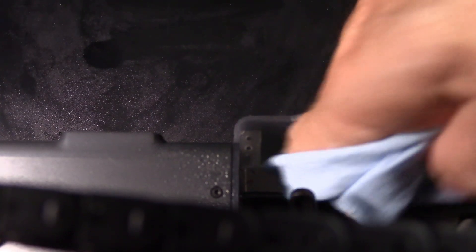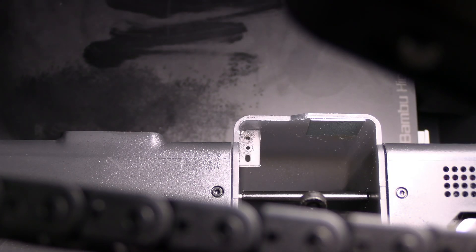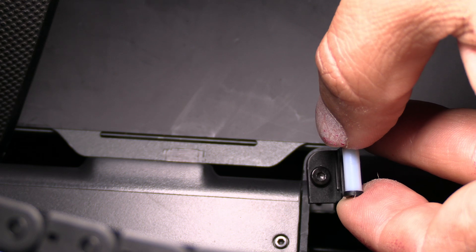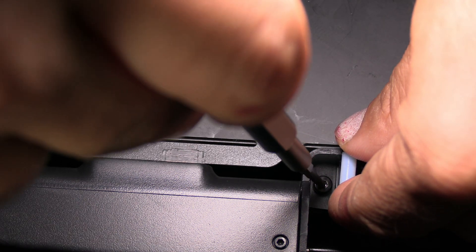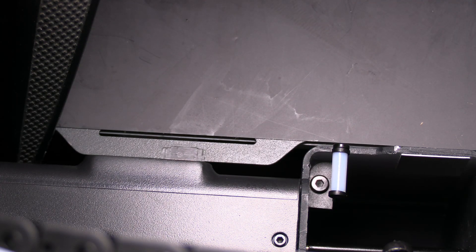While I'm in there, I'm going to rub this little door and the walls all around it. Because if the walls of your poop chute have anything sticky on them, it can prevent your poop from properly sliding down the chute and out the back of your machine. Get in there and clean it. It's kind of like how solder will stick better to solder, glue will stick better to glue, filament will stick better to filament — so get any filament residue off that little pad. With all of that done, go ahead and place the new wiper. I would start with the screw in the wiper, place it on its mount with one hand and bring in your screwdriver with the other. Your new wiper is installed.